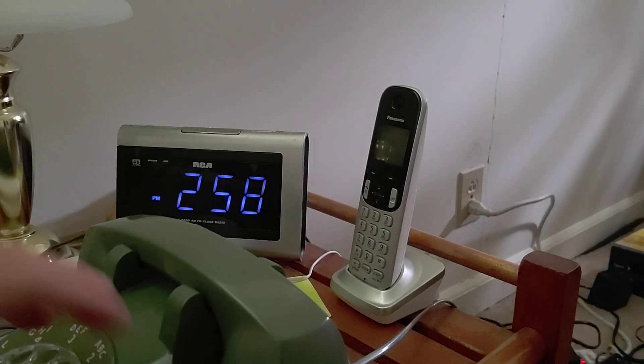I hope that's helpful to you. That's really nice because now with that PBX trunk, you can use any phone on any ATA to make regular PSTN — public switching telephone network — calls. Because of this, I've used my rotary phones to make work and errand phone calls. Now you have an interesting option for a landline connection that you could even connect over SIP, over Wi-Fi, and have different extensions of your PBX dialing other public telephone numbers. If you have more questions, leave those in the comments down below. Like and subscribe, and have a great rest of your week.